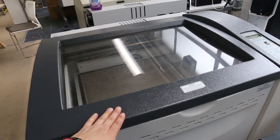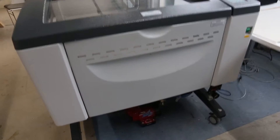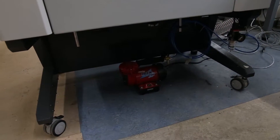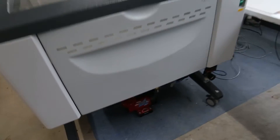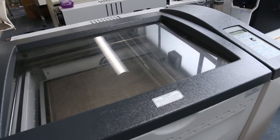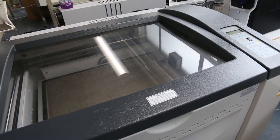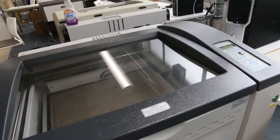This is the actual cutter machine. There's a second smaller machine underneath and eventually this is going to be replaced. This is a compressor which feeds a pulse of air to the cutting head, which helps prevent any kind of flame building up where you're cutting. It blows the smoke away — but actually it's to get rid of the gases that might set on fire.